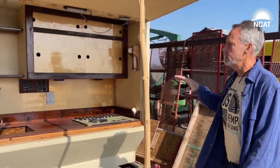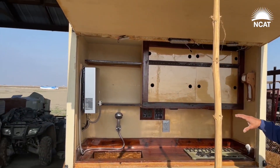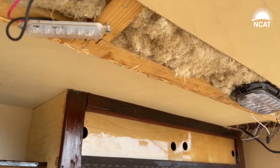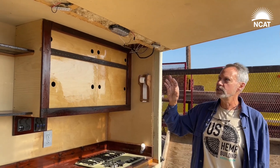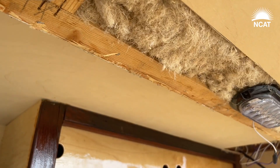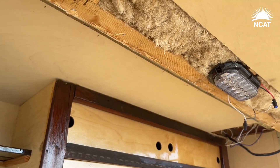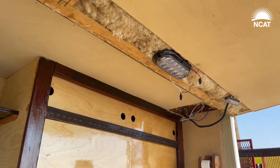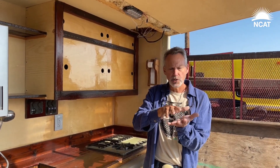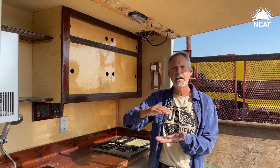Here's a little tiny hemp home that I'm working on right now. This is hemp fiber insulation — called hemp wool insulation. Basically what we produce in the gin here can be turned into this very easily — it's just one more step in the process. This is called a non-woven process. They weave it — even though it's called non-woven, it gets woven in. It has about 8% nylon in it as a binder, and that holds it in place. This is made into insulation batts.